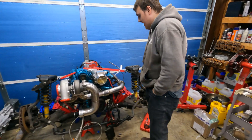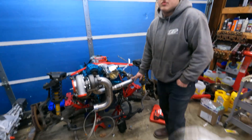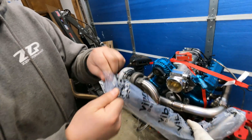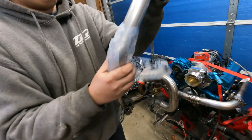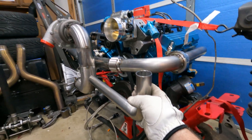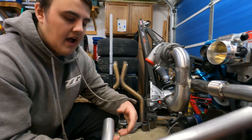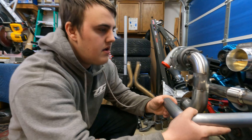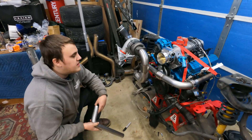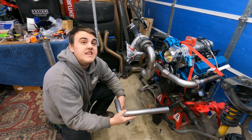Look at that — that looks awesome! We were able to get everything lined up how we needed to. What was great for us noobs is this flex bellow is allowed to move a little bit — that gave us a little bit of movement we needed to line up this pipe here. We'll be able to tack or fully weld all of it together. I might on some free time add more tacks to make it stronger, but with this side tacked up kind of fully, it's strong enough to hold everything. As long as our cutting skills are good.